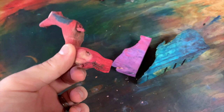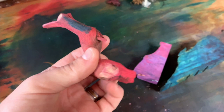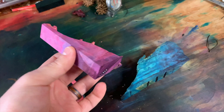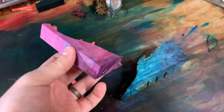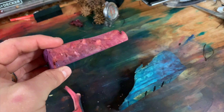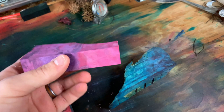The other really important reason for sanding — even if you just want to do the same color again — is that if you don't have full penetration, you need to open up the pores so the next color can penetrate. If you think about what cactus juice is doing, it's curing and sealing off the wood. If you sand it, you break into where it hasn't penetrated and allow the new color to penetrate much more easily. You probably could get away without sanding to some extent, but for best penetration I highly recommend it. And as a bonus, you can see how far the first color penetrated.